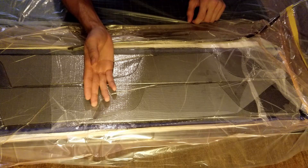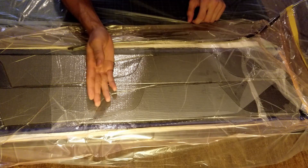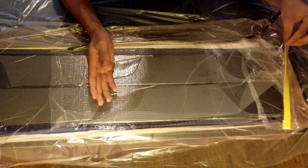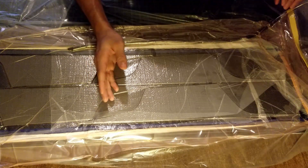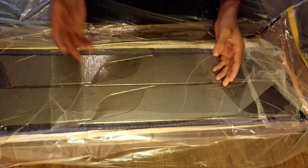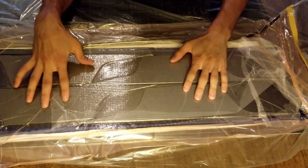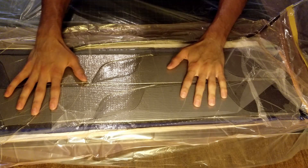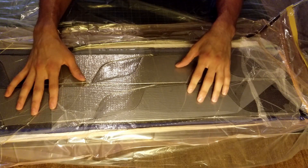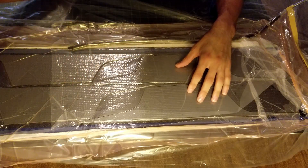I've temporarily stopped the pump now that all the air has been removed, just so I can check by ear if there are any air leaks hissing away at the seams. It all seems to be good, so I'm going to keep the vacuum pump running, weigh these parts down so they're flat to the table when they cure, and come back in a couple of hours when the epoxy is halfway cured to cut these out with a knife.